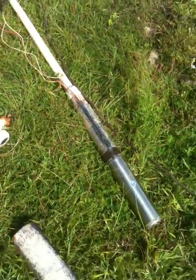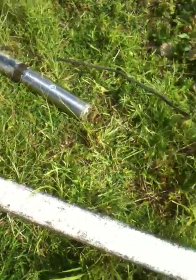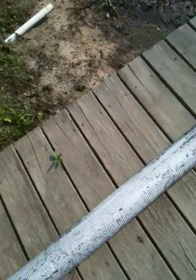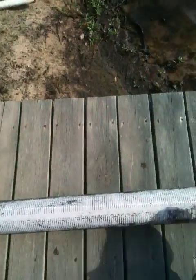It's connected to a sta-rite pump. As you can see, I don't have it in the actual unit here, but it goes into a four-inch conduit, and the conduit comes down to what I have — it's like a tripod. Again, common components from Lowe's or Home Depot. Down at the end is a very long feeder pipe which has slits in it. This is what some people use in French drains — it lets water in but keeps out the sand, mud, and rocks. So this section of PVC is your filter.